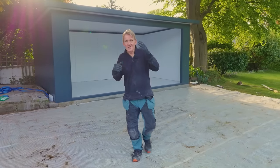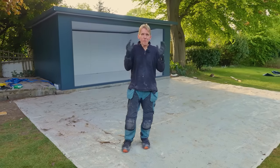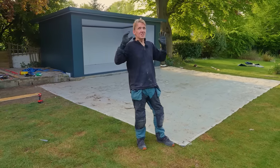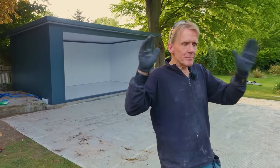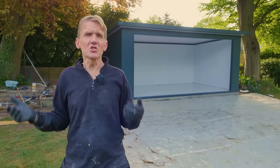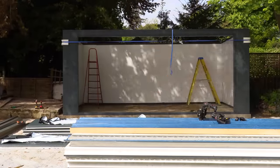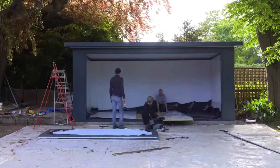If you're going to do it, it's better to have a couple of people — three people would be very good. Read those instructions. Read them before you even start, read them again just before you begin the job, and keep referring to them all the way through, because it does matter and it saves time in the long run. The key thing is: when you get that base in, get it absolutely to those dimensions. Make sure it's level all round — just take time to do it the day before you want to start so you're absolutely happy with it. Whether it's going on concrete or timber, make sure it's stable, exactly right, and level — because if you do that, everything else will just fall into place.